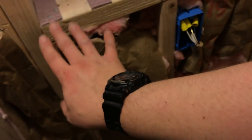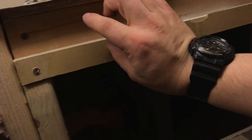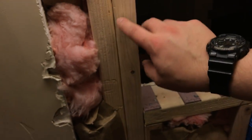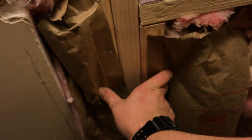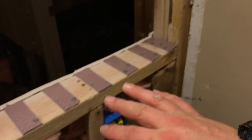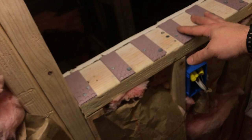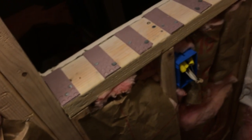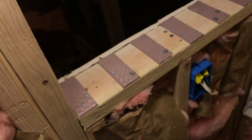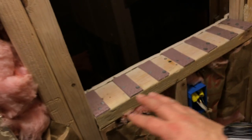You want your wood to sit on top of wood, so you have your cripple studs supporting your sill, and then jack studs supporting your header. On either side you have king studs that go all the way down to the floor — there are actually three there. You want to use longer nails than you think — like three-and-a-half inches. Get a couple different boxes of nails for different lengths. Sinker nails have a coating that helps drive them in easier and a textured head so your hammer doesn't slip.